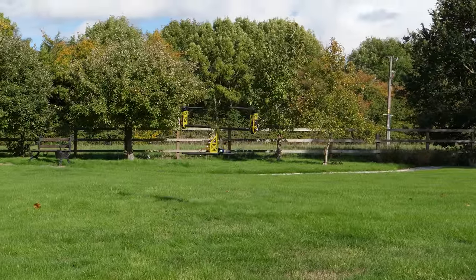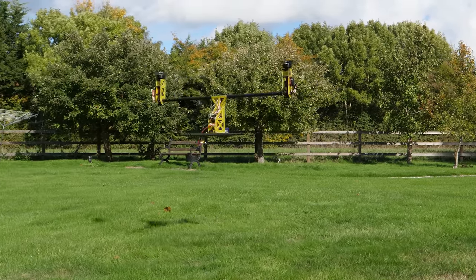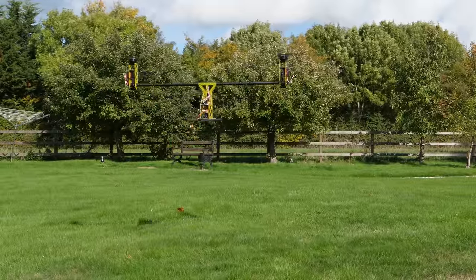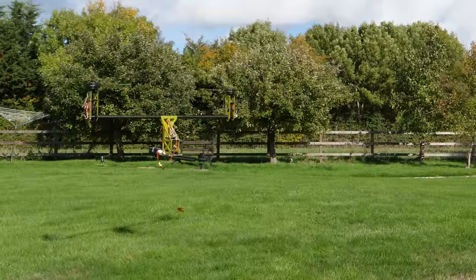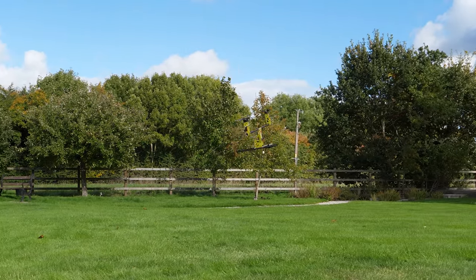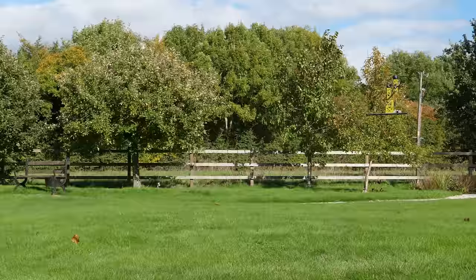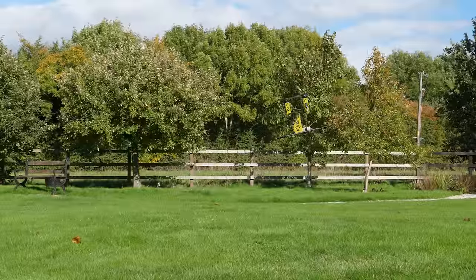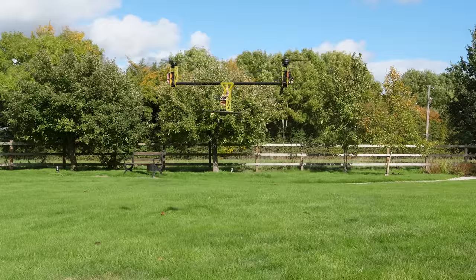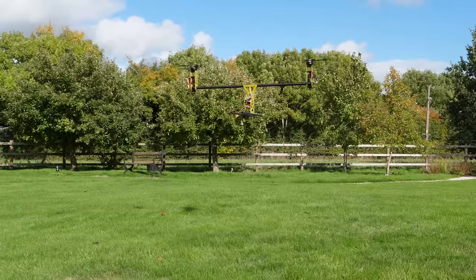Finally, it's flying without any braces on the wing spar, and the complete motor tilt mechanisms attached. And surprisingly, it feels quite stable even on this windy day. It's also quite maneuverable, but to reduce vibrations I've put a limit on how much the flight controller can vary the motor speeds. So in extreme control situations, or with a huge gust of wind, it struggles to return to level. Having said that, I probably won't be flying as extreme hovering maneuvers once the large fuselage is built.